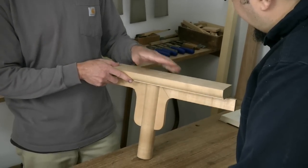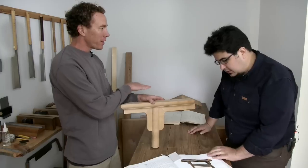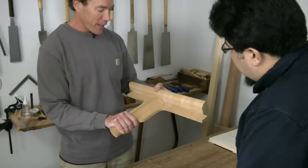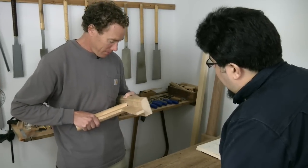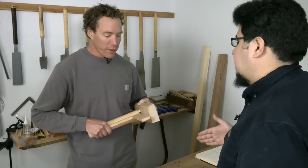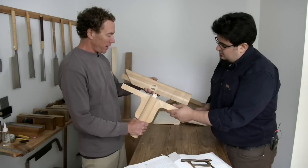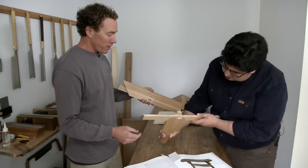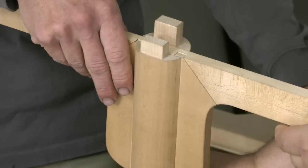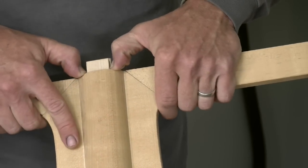This is the tabletop. Generally, tabletops in traditional Chinese furniture were frame and panel instead of being a solid top. The benefit of that means you can plug your leg into the frame. With a solid top, you have the expansion and contraction issue — you can't plug legs into it. But with a frame and panel, you're able to. It's just another strength to the leg — it's a pivot point that can't move. That begins the strength, and this is what finishes it off.